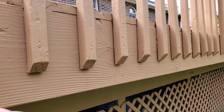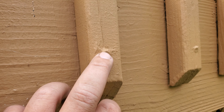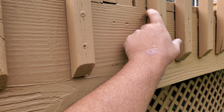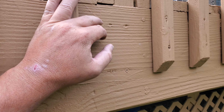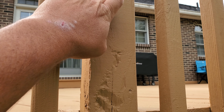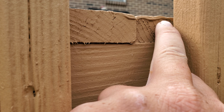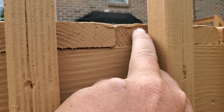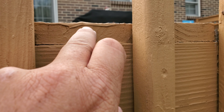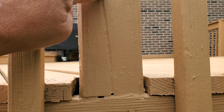But it's meant to keep the deck surviving the elements long term. Specifically what I'm looking for when I go through one of these decks: I want to see the fasteners are covered over, I want to see that they're not going to corrode any further, and we're not going to start having loose spindles falling off. I want to see that the majority of these cracks here are covered in — we had some giant monster ones here that we did cover in. I want to see this frayed wood covered up. And it's okay to see a little bit of this thick build here on top of the boards — that just tells me that the top of this deck is coated massively thick. You see this thick build here? That just tells me we have a monster layer of coating up there, super build on the deck floor. Here's an example where we had a monster crack and it's filled in.